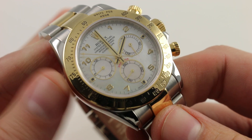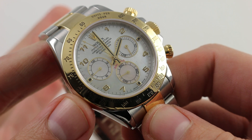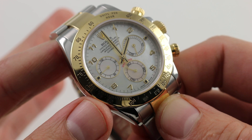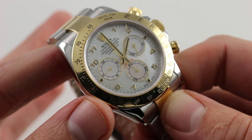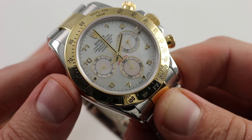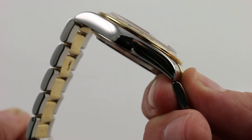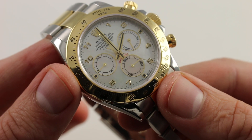Mechanically, it's the in-house caliber 4130, 44 jewels, smooth bi-directional winding, a COSC certified Swiss chronometer. It has a full balance bridge for robust anchoring of the balance and the hairspring, and it features a free-sprung architecture — the balance is adjusted via Rolex's proprietary Micro-Stella system — so bumps, vibrations, and disruptions on the wrist will have less impact on precise timing. It also has a Breguet over-coil hairspring, such that positional or gravitationally induced timing deviation is less of a factor.